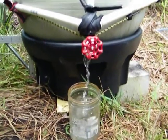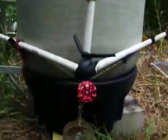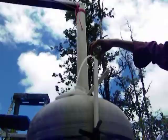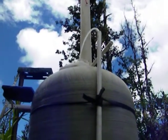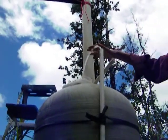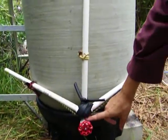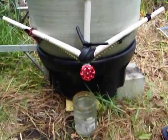And that's about the speed that it goes. That has to do with how wide this pipe is, right? It has to do with the narrowest part. So if we wanted it a bit faster, we could get a slightly thicker pipe. And to get it started, I just sucked out the water without drinking it, because it could have slugs or whatever in it. Once you have the tube part full, it'll just flow so long as the bottom is lower than the tank level. Right now the bottom here at the spigot is about as low as you can get on this tank, so we should be able to use most of the water level.